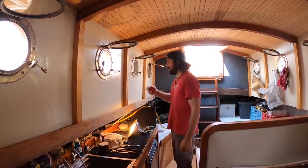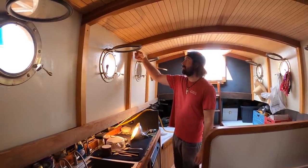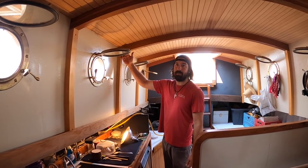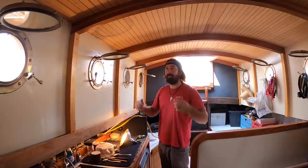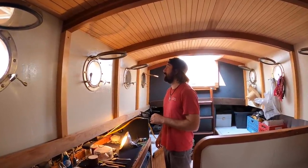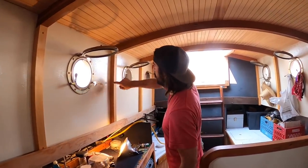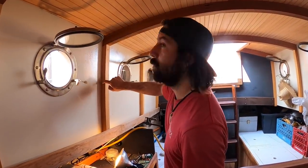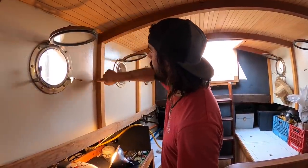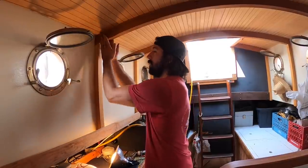And then I put in all these uprights that basically just butt into these beams. The last two aspects of completing that structure: on all of these beams and these uprights, I want to put knees, whether they're wood or metal or whatever, just some knees that are nicely bolted and secured to tie this together really stout.